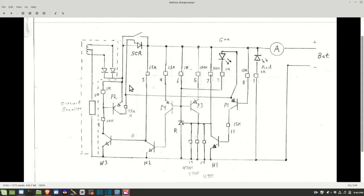But at the same time, I'd like to know if any of the rest of the stuff is bad. If I flip that switch there, I think I can get the same as if the SCR had been switched on. That's the only difference, because it's a switch across there. And that's the switch for the SCR, right up here. Once it's on, this is just a solid line here, just like this would be. So that's the only thing the SCR does.